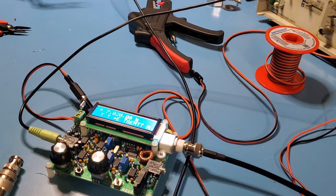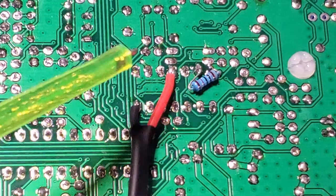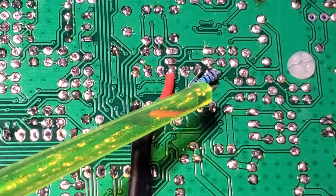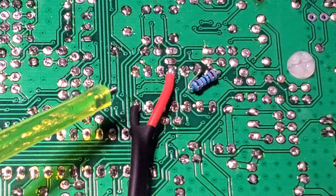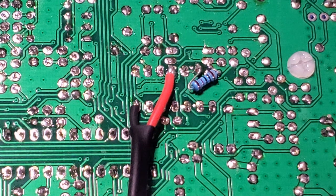What I'll do now is solder the wire to pin 11 on IC3 - pin 11 of IC3 is 5 volts on transmit. As you can see here on the underside of the board, IC3 has the 10k resistor soldered between pin 14 at the end and pin 13. I'm tapping off pin 11 for the transmit signal, which will be five volts. I've also got ground connected to pin 7 of IC3 as a convenient ground, and I have these two wires coming off.